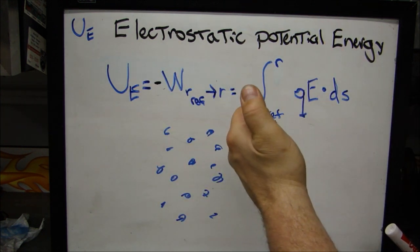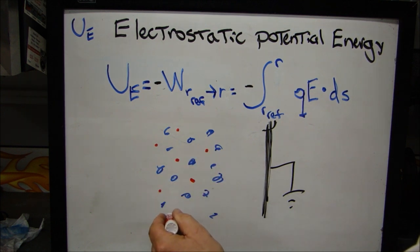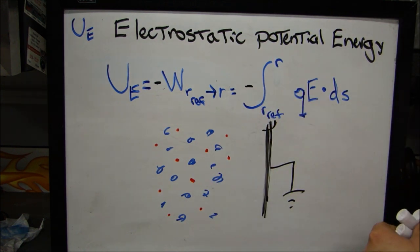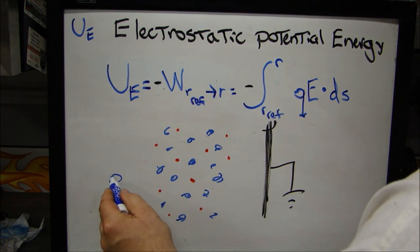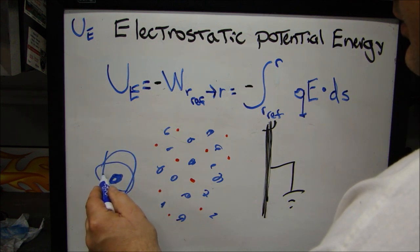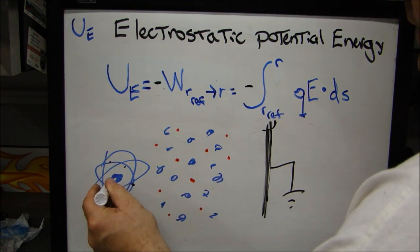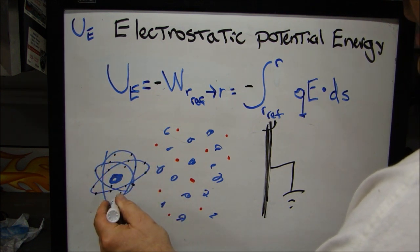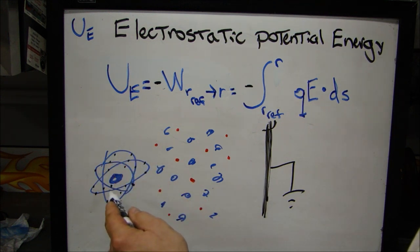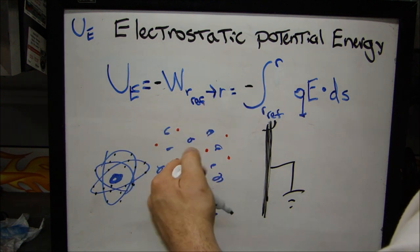When you pull the trigger and the powder passes across the high-energy field in your gun, ions are added. Those ions create potential energy. Here's your basic atom — a nucleus with electrons on the outer rings. You have your atom of powder: a molecule of resin, polyester, whatever it is. When you pull the trigger in the presence of electricity, an extra electron gets added to the outside ring of this atom. When you add the extra electron, this powder becomes negatively charged — it has a negative electrostatic potential, U sub E.